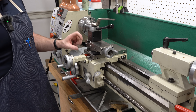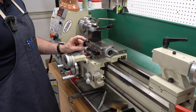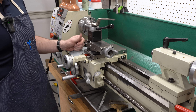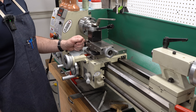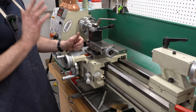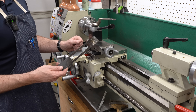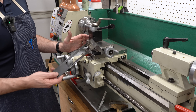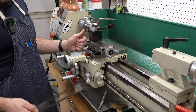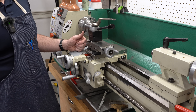Coming up in the future, I've got some other projects for this lathe. I do want to make a solid tool post support and delete the compound just to improve the rigidity of the machine, and I have an idea for a different quick change tool post that I'd like to put on it. Be sure to subscribe to the channel if you want to see that in the future. For now I'm just going to use it as is — and yeah, I know I left out the dust shield. Why didn't you say something earlier while I still could have put it in? Now I'm going to have to tear this all down to put this part back. I'll do that off camera so you don't have to watch, even though it is kind of your fault.